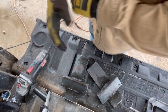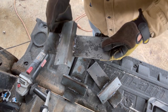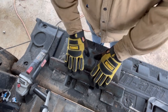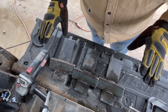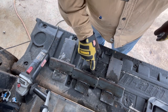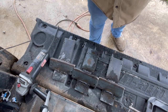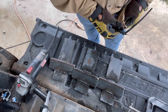Skipped a few steps here — the boring stuff — but basically what I did is I went ahead and cut all my other pieces and made three more brackets just like it. So now I have all four of my brackets built and welded. Next thing I'm going to do is take my grinder and clean all this up — clean all the slag off and clean up these welds — because I have to clearance this part where it's going to hit the gunnels on my boat. Then get them mounted for the last time to make sure everything's good before we paint them.